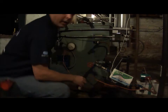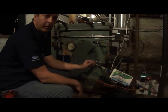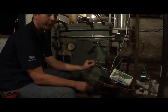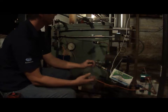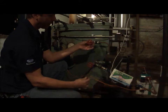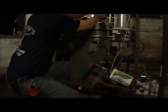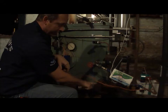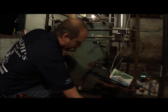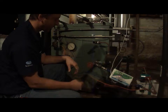Okay, so here we are, second week of running the Clearwave through the boiler, trying to see if we can clear it out. I'm going to videotape myself videoing the inside of the boiler so you can actually see where I'm doing things. We're going to do this upper sight glass port. Normally you'd have your upper valve and a sight glass in there so you can see the water level. So we've removed those. And second place is this lower nipple port. So we're going to send the video scope in there so we can see most every section as we go along.